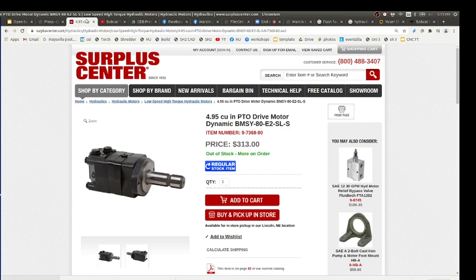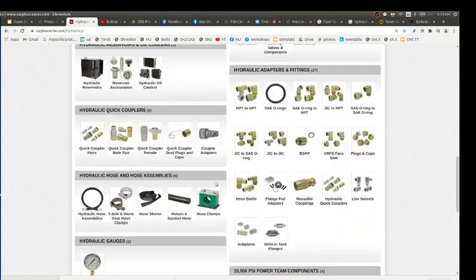That's the basics of just some of the components. There's hoses. A lot of the stuff we use, the way you screw things together, is just fittings, which are national pipe thread fittings. That's a lot of what we do. There's fittings that have O-rings in them. We try to stick to the NPT, since the O-rings are specialized. When you go to shop for hydraulics and hoses, you've got all these pre-cut lengths here.